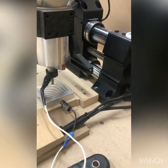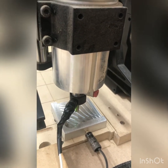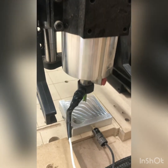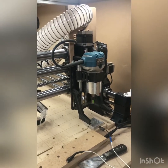It's going to head down and touch off on the plate there. What this is doing is just taking an initial measurement of where that bit is touching the probe. Now we've got a pop-up: Remove probe magnet, click continue. Magnet's off, and we'll hit continue.